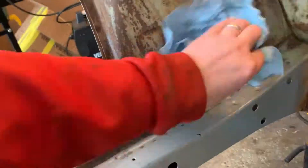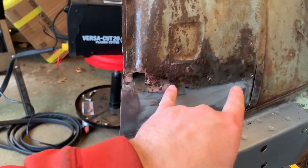I'm going to let that dry. Now I need to wipe down the front end — shouldn't have to spray any Weld-Through Primer on that; I already had the backside primed. I've tried welding through Weld-Through Primer before and it's not the best, so we're just going to clean it up and get it ready to weld in. I did drill three holes for plug welding to hold it in place to give it a nice tight fit. Then we'll seam seal it across the top. I didn't think just plug welding the whole thing would look that good — this way we'll still be able to see the line. So that's my plan.